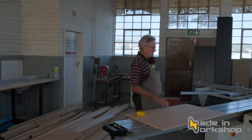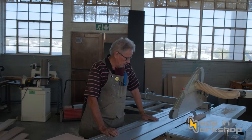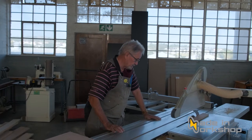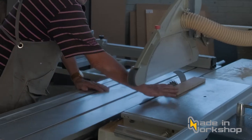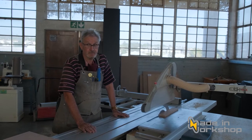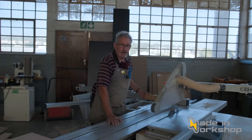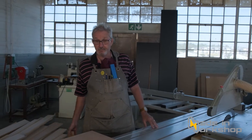You'll notice there's a piece of wood lying on the saw. What a lot of people do is while the saw is running they reach in and grab that piece of wood. I'm waiting for the saw to stop — that blade is still spinning, and it will cut you. If it's still spinning fast, it will take your finger off. You could pull the wood away sideways, but I prefer that you wait for the blade to stop completely before removing that piece of wood.